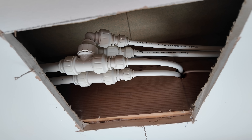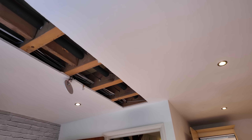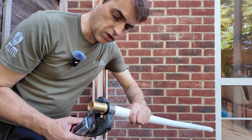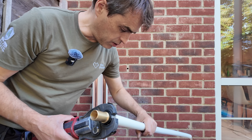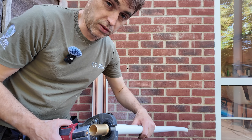What options do we have to make sure this setup will work? You can re-pipe — that's usually very disruptive and expensive — or use separation and put a secondary pump to overcome the resistance. What I'm going to do here, because this is my index circuit with a known big pressure loss on microbore, and the ceiling is already opened, is re-pipe this section where I can see it tees into 15mm. I'll leave the 10mm in the wall — that's 4 meters — but replace everything accessible on this radiator. I'm going copper from the heat pump to inside, then switching to multi-layer composite pipework, which is a godsend for going across joists — much easier than copper.